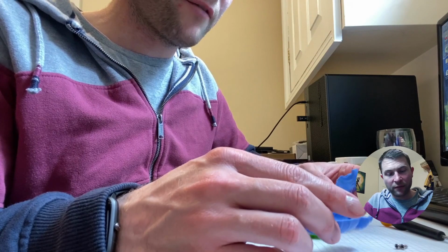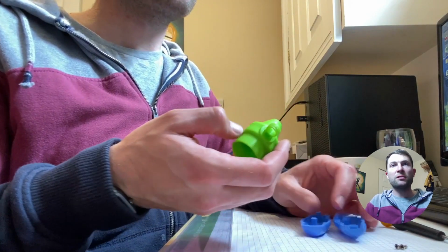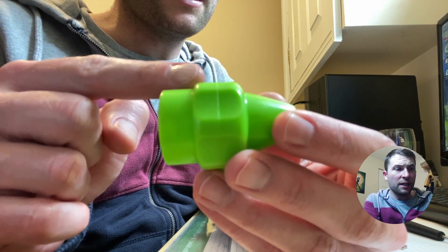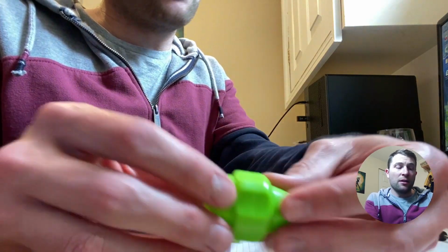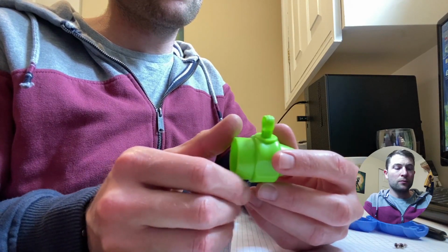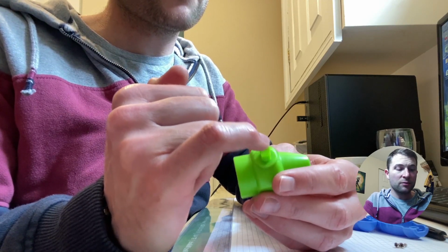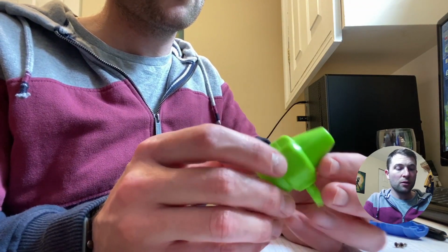So what can we pick up from these parts? Injection moulding: these are basic parts, there's no undercuts. So we can see on here that's the split line on the part, and that means that the tooling direction is this direction. That's how it's moulded, and you've got the feed point that you can see here. That's where the molten plastic material is injected into the mould.